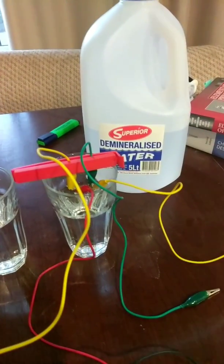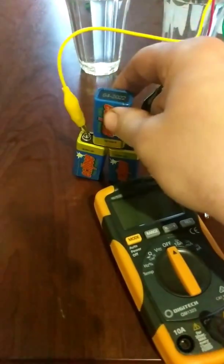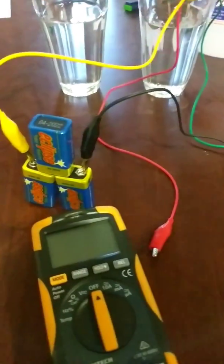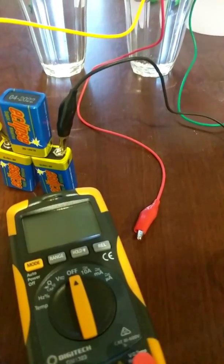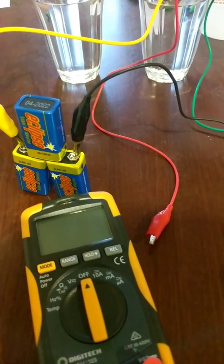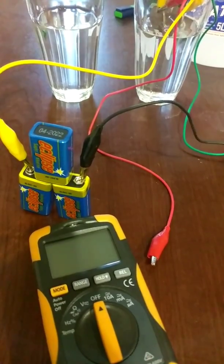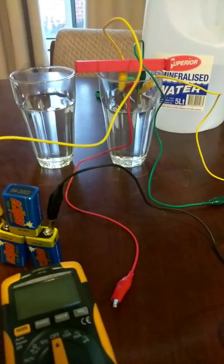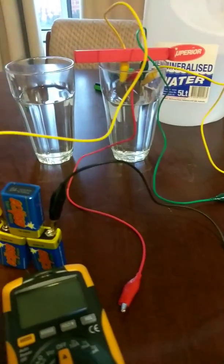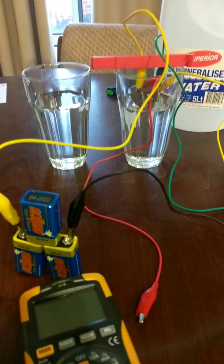So if you've got 240 volts and you're putting it through such high resistance, and keep in mind that's 10 times what this is, so you need 10 of these for 240 volts, you'd realistically end up, I would assume, with 10 times the amount of voltage, which is about 1 to 2 millivolts. Now, I don't know about you, but I don't know of any household lights that run on 1 to 2 millivolts either. So they're using an inadequate testing method because the test does not have a low enough detection range. Okay, so it's not going to pick up. It's not going to give them a true positive. It's going to give them a false negative. So that was a big error with their test regarding this.